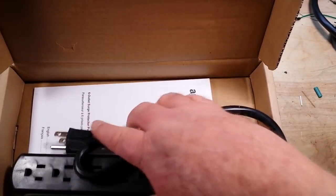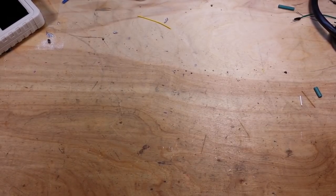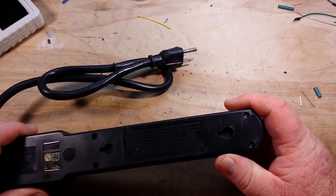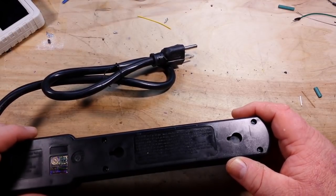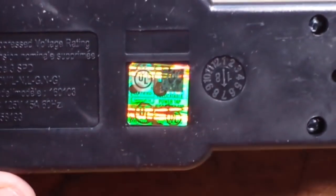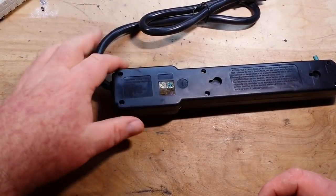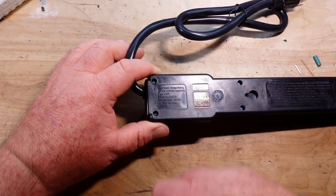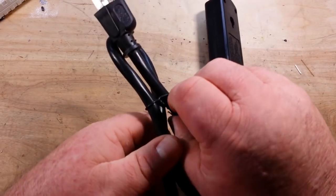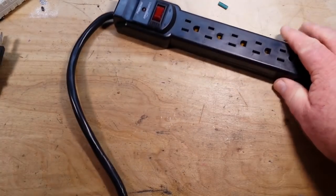We're going to base our assumption off of one of these. There's nothing you can do about random assembly error — if it happens, it happens. What we're going to test is whether or not this is wired safely or is going to cause any problems in your home. You can see it does have the UL label, which is the Underwriters Laboratory here in the US — that's a good sign. Doesn't mean it's not forged, but it's a good sign. Suppressed voltage rating: 800 volts. So it'll stop a spike of 800 volts. Is that going to stop lightning? Oh, hell no — you're talking hundreds of kilovolts and probably kiloamps. But this will take the first hit.